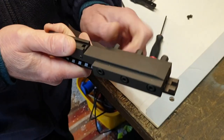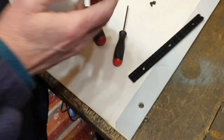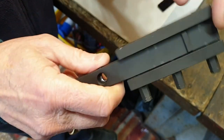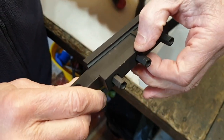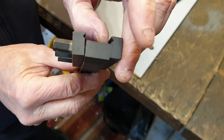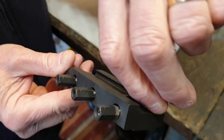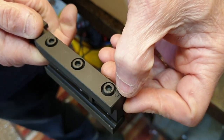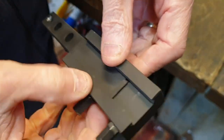You can see how Kevin's made this to minimise machining difficulties. The central part is one single piece, and he's machined the slot that locks into the grooves of the Picatinny rail. The movable part locks in at one side; the other part he's machined separately — you can see the join — so he can make the groove easily in a long bar. He's probably made these two pieces from one bar, machined the slot identically, then chopped, drilled, tapped, and pinned one piece onto the main body to make the fixed side of the clamp.